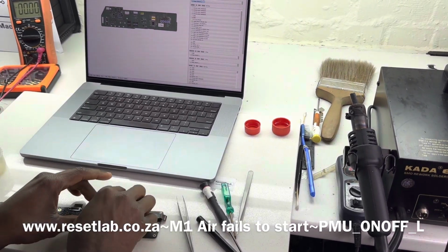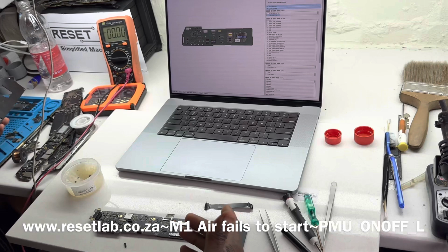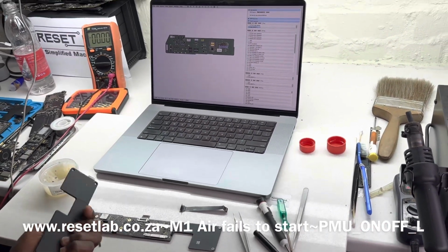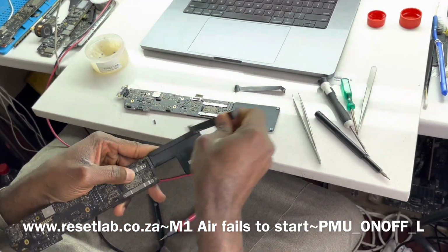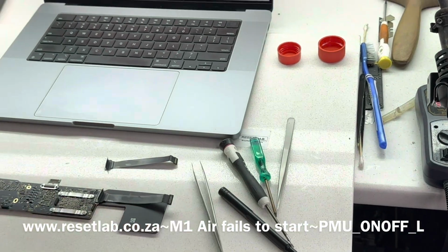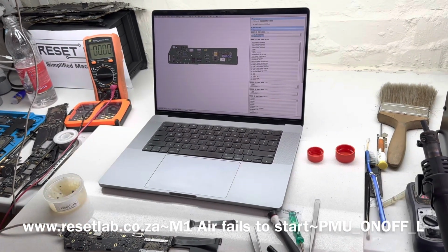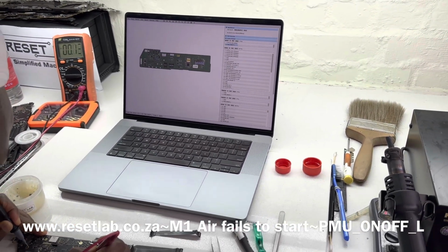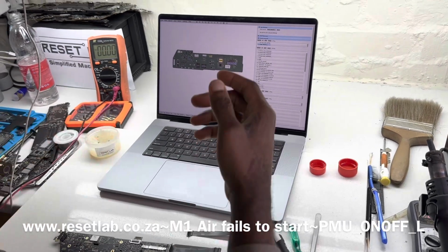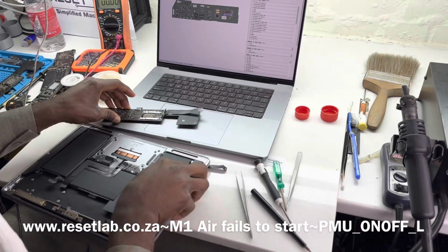The next thing we want to do is install another cable. If it's still low, then it means our problem is the connector, not the cable. We can't verify that, so let's install a different cable and see what we get. Okay, a different cable is installed. We do have pin 1 at 1.8, pin 2 at 1.8. Okay, that looks good. Looks promising. How interesting is it that the cable was pulling the signal down.